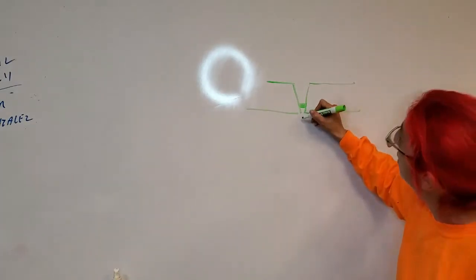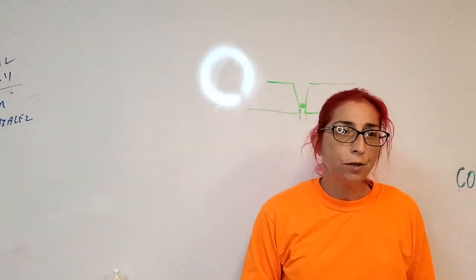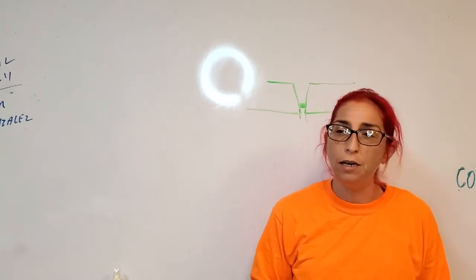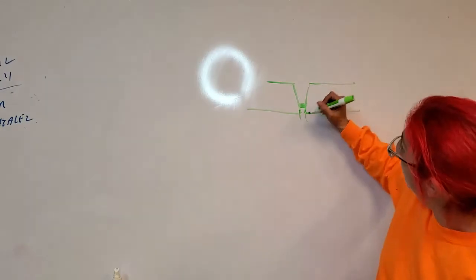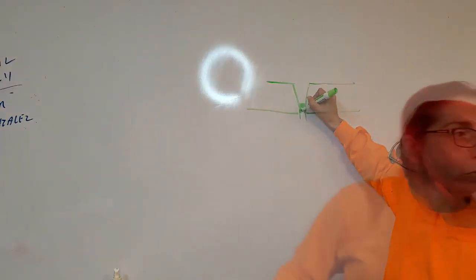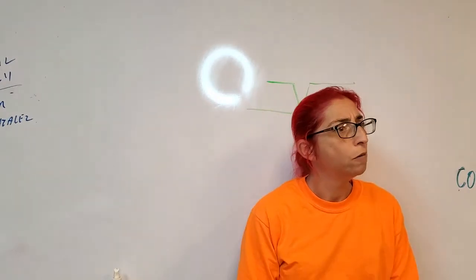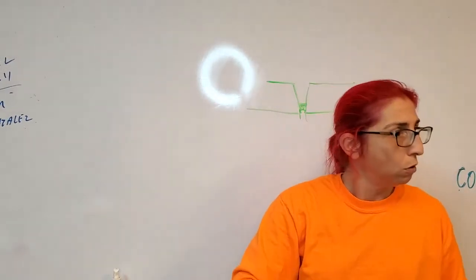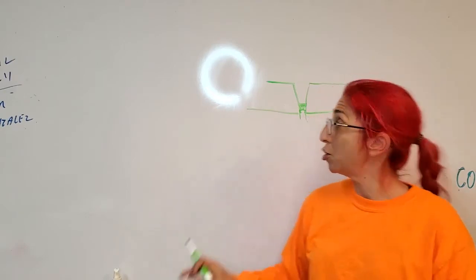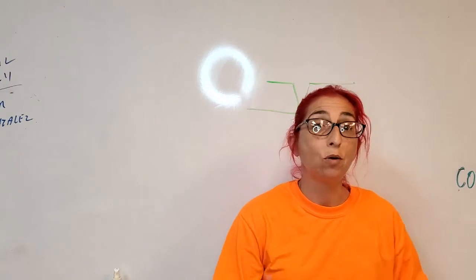This can also mean my root opening is incorrect. Instead of having that quarter inch, well, I kind of goofed, made it a little too tight. Usually what'll happen is you get about here. That's about as far as you can go. So it's really important that we pay attention to those things, the included angle, groove angle, or bevel angle, to make sure that we have the correct angle here, but also that we have correct root opening.